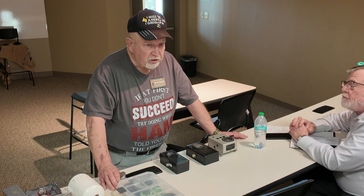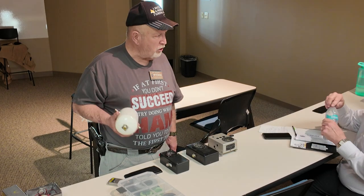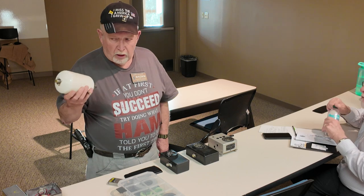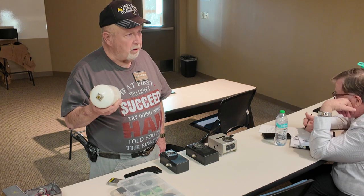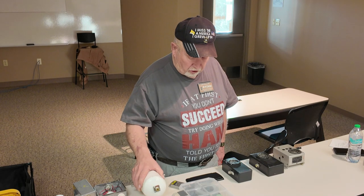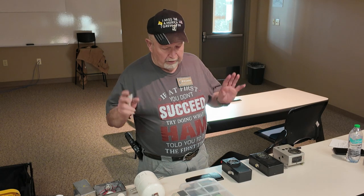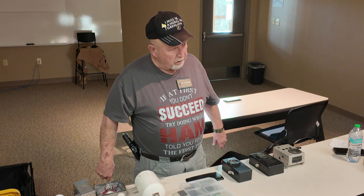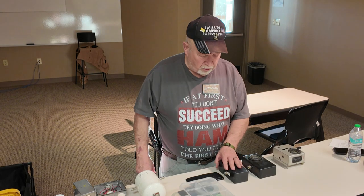And what I have found is that a balun swallows up somewhere around 25% of the power that you put through it. Which means if you've got a 100-watt radio and you transmit into an antenna that's got a balun on it, you're only going to get 75 watts out at the antenna. So, if you don't have to have a balun, I don't run any baluns, except where I'm trying to match the antenna, get the impedance down to where I can handle it better, especially through a tube amplifier.